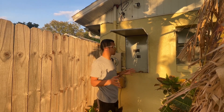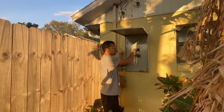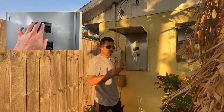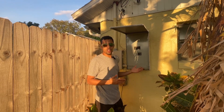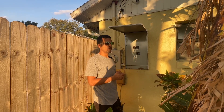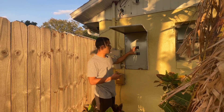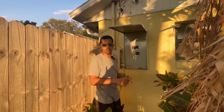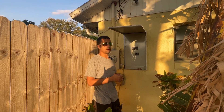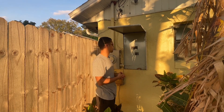If the house is vacant and nobody is inside, always turn off the main power — that way there's no power running through the panel and you don't have to worry about shocks. You can still get a shock in a rare case of residual current, but it's very unlikely if you turn off the power. If people are living in the house you can't do that, because it's going to reset clocks, stoves, fridges, and everything like that.